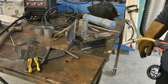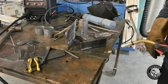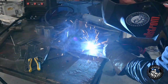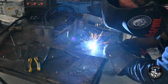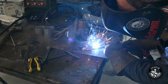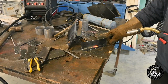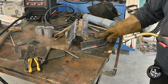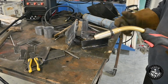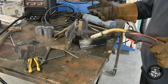So that's using the Synergy setting, and it's pretty well bang on, hey? Yeah. See, timing was out a little bit in the middle there. Man, that weld's nice. Get a little wider if I want to. That's beautiful. That's 1/8 inch. Of course it's going to weld that, right? Yeah, for sure. But most stuff you're using with a MIG, for me, is the thinner stuff. It's cool though that the Synergy is bang on, hey? Yeah, it's perfect. There's no spatter.